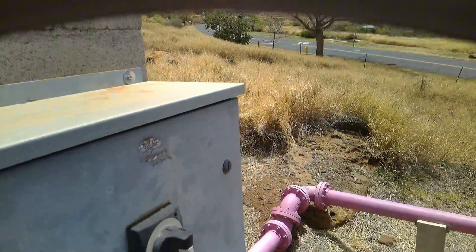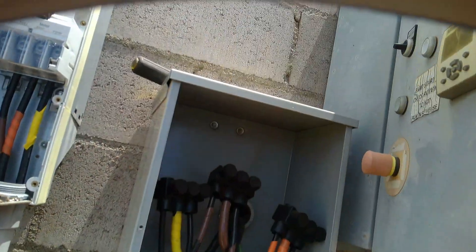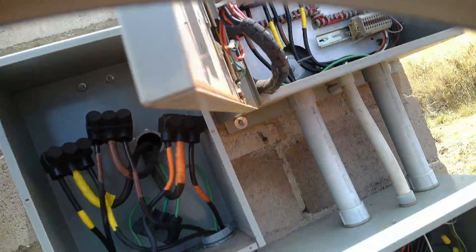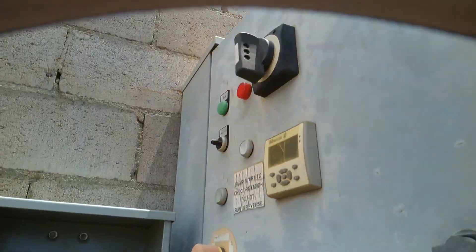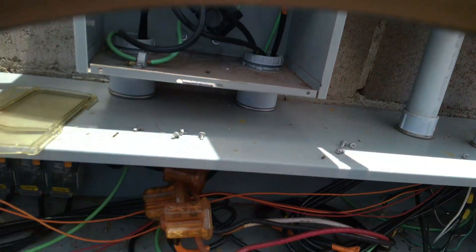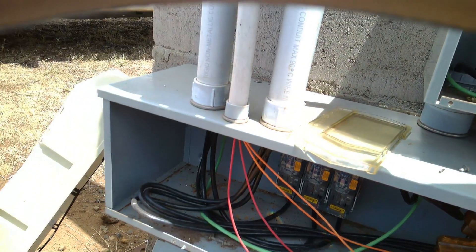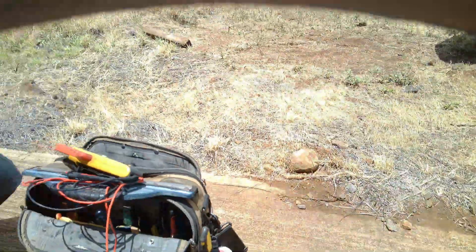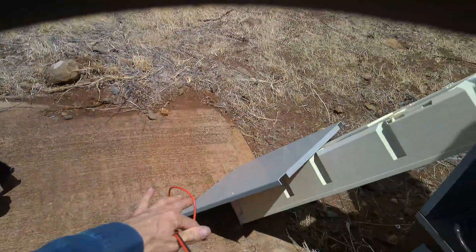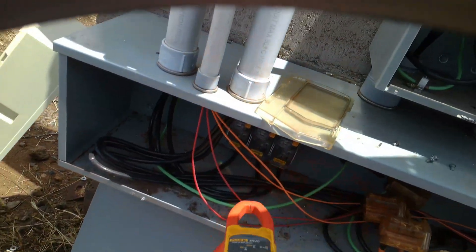There's no line in here. It comes from the service on the other side of the wall, goes down into the gutter, and up to the motor contactor - to that disconnect switch, from the disco into the motor contactor, and back down. These wires are just coiled up doing nothing, so hitting start/stop does nothing right now. The motor leads are in these power blocks and could be moved over to the contactor, but right now they're on the VFD. Power also comes from the service down this left-hand conduit into the line side of this fuse block - and they are probably blown.